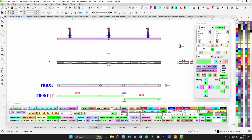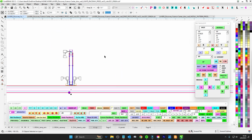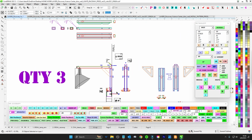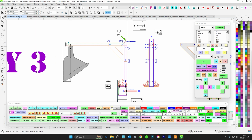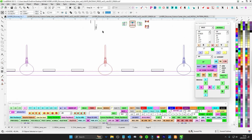So install is going to go ahead and put the raceway up first. Then they're going to nail these down, frap, and then they're going to hit a screw right there with those to hold the lamps up. And then we're going to run the wires. Like I say, you probably want to do a black and white junction here, bring wires out and give them a foot or two in here, and then they're going to distribute power.